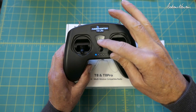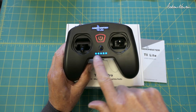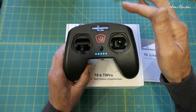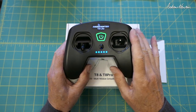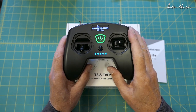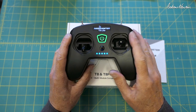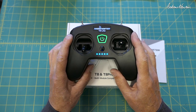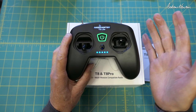Let's turn it on. Let's put a switch out of position first. So that tells us the battery level - a hundred percent. I've got a switch out of position; they should all be back. It's giving me the warning and now it turns green and stops beeping. The RF chip is the CC2500. You don't get full access to the CC2500, I believe.